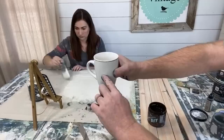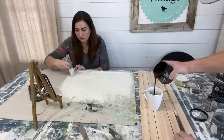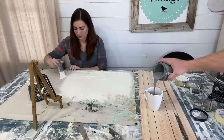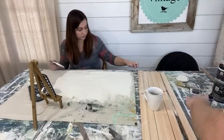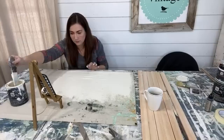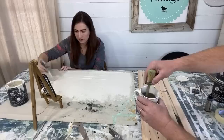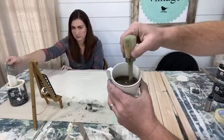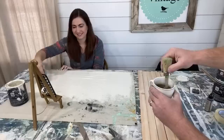I have a lot of water in here and I'm just going to add some Dark and Decrepit — just a little bit to tint the water — and some Old and Gray. This is one of the ways I've been mixing up stain for our restoration finish corbels that we sell on the website. I'm just going to mix that up — both Old and Gray and Dark and Decrepit are water-based so they mix well with the water. Now we've got this nice coffee color — depends on whether you have coffee with cream or black coffee!